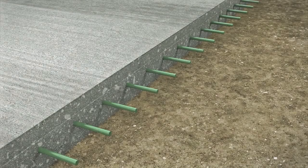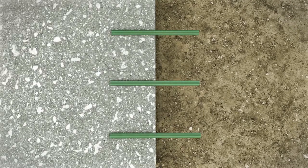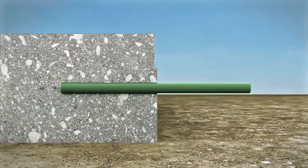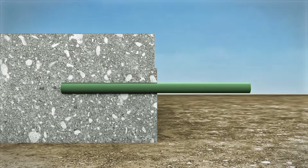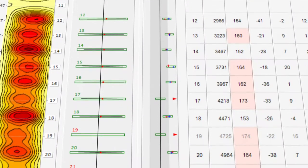A properly placed bar lies in the vertical center of the slab, perpendicular to the plane of the joint cut, with its center in the plane. Deviations from such a prescribed position are described by the horizontal translation, sideshift, horizontal misalignment, vertical translation, and vertical misalignment. The magnitudes of these parameters are given as the results of a measurement.